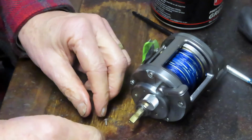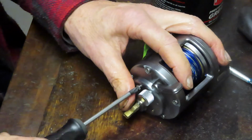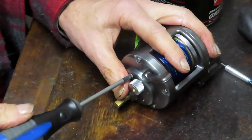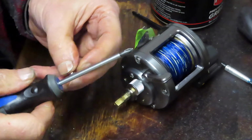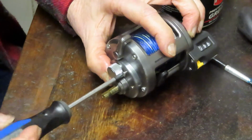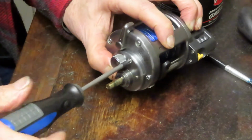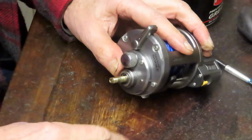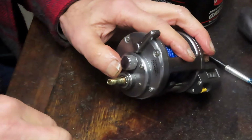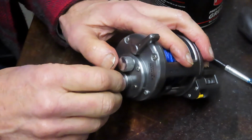I'm going to go into my parts tray to get for that. Those are going to hold the bridge plate in position. That's the ones that are going through the two studs on that yoke that have the springs on them. One on the other side here. Okay, then we'll put those two more small shim washers on here for the other side of the bearing. And if you had any questions, there's a lot of little small pieces and parts here. If you had any questions about the sequence that you're installing in, this is a good place to go back and reference your pictures that you've taken so that you make sure that you get this right.